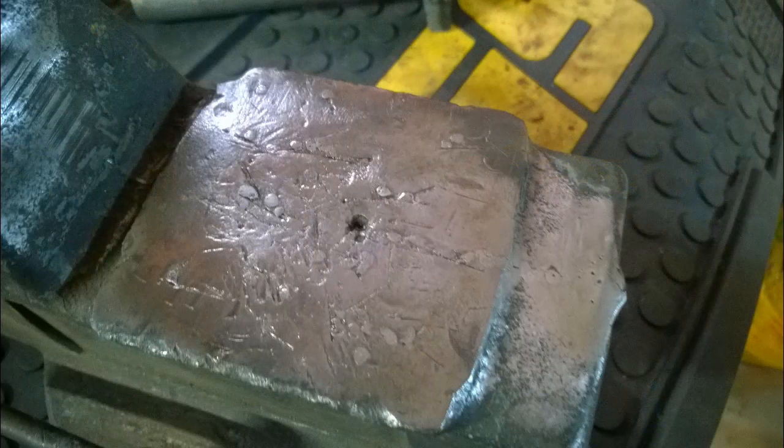Here's a close-up — you can see the crack's been smoothed out and the plugs are back in. We're going to take a little fiberglass body filler, smooth everything out, and it's going to look terrific. Then we're going to hit it with that verde green Rust-Oleum paint and follow that up with clear coat for extra toughness. The anvil itself we're going to paint silver for a little contrast. Next up, we've got to take care of that handle.